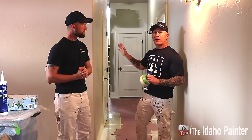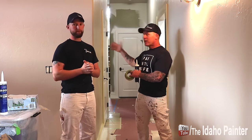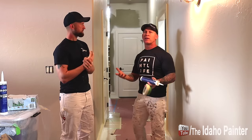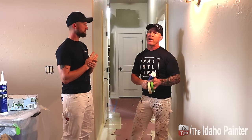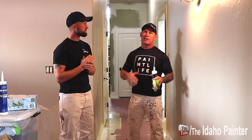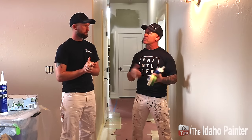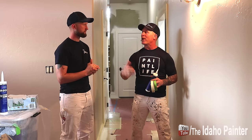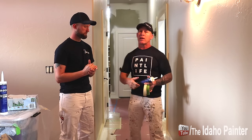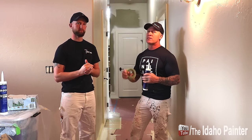So this color is very very natural and light — we don't have those issues, and we have the freedom to experiment. We know with this color we've got the freedom to work ahead rolling, which is great because we had sprayed the trim but needed to buy some time while that was drying — we can just start rolling walls and ceilings and then come back in after the trim sets up and start trimming those pieces out. This paint and color is very forgiving. We roll the walls, come back and do the cut-ins, and you're not gonna see any haloing.